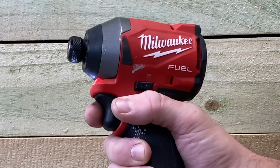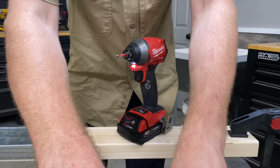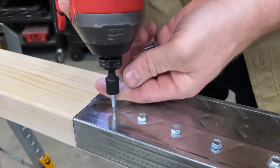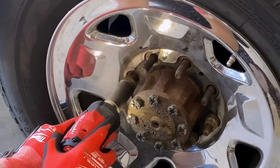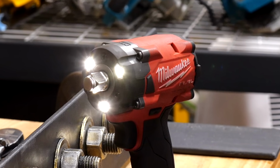Let's dive a bit deeper into these collets and drives for a minute. So impact drivers all have that 1/4-inch hex collet no matter what size, performance level, or voltage that you got. Most common impact wrenches are going to have a 1/4-inch, 3/8-inch, or 1/2-inch square drive, and that measures the distance across from side to side, not front to back like some people might think.